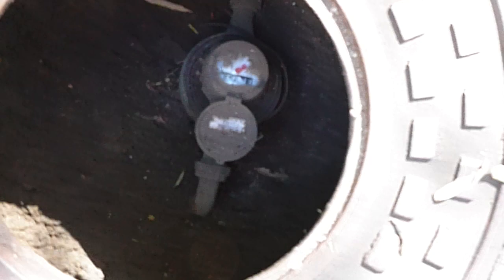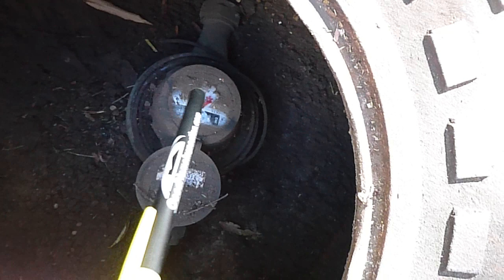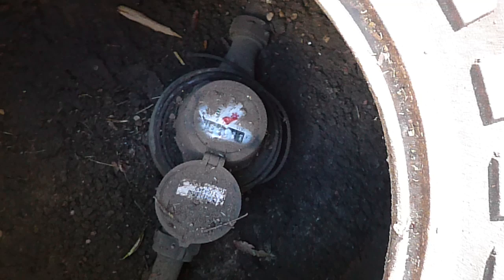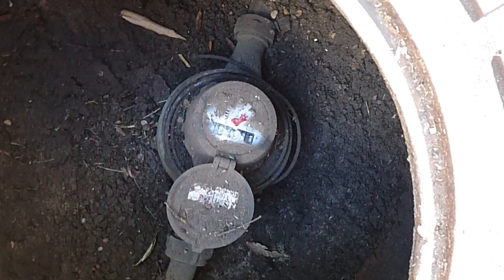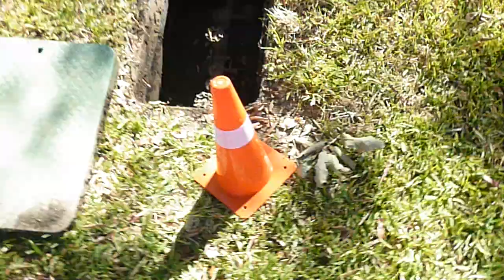We're at the front of the house. This is the water meter — it's in the parkway sidewalk. Inside the dial you see a little sprocket called a cheater wheel or cheater paddle. If there is a leak on the supply side, that little dial will move. If you can't find where the leak is, it's somewhere you can't see inside the yard.